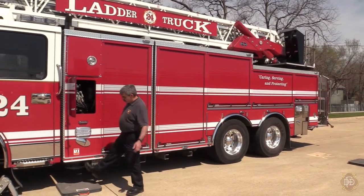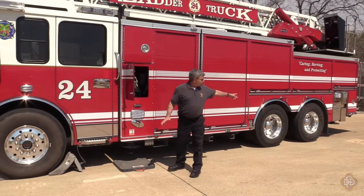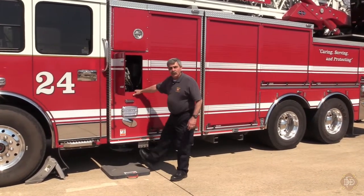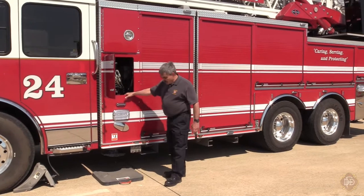Look around here and kick this plate. What happens a lot of times when guys bottom out or hit a curb — especially on the rear ones when you're doing a big angle of departure — you'll break some of the attaching bolts on these plates. In the morning, it's better to find out that it's really loose and get it fixed than to have it fly off.